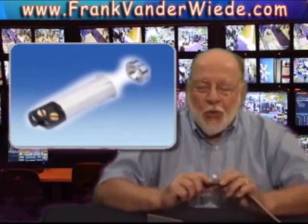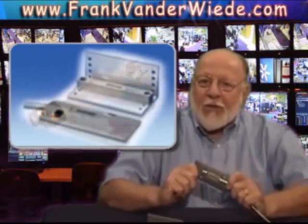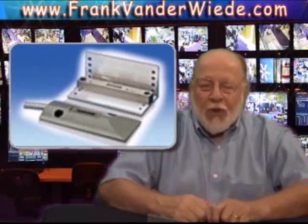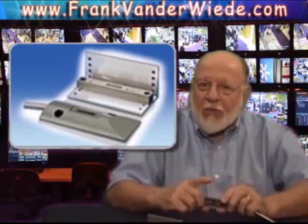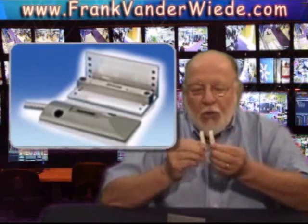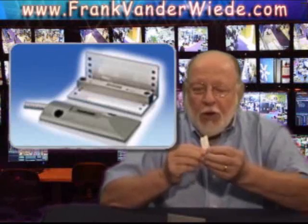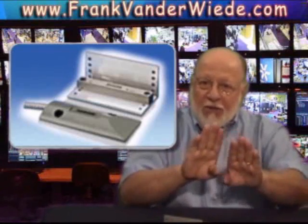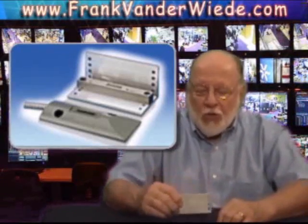The last type of door sensor I'd like to show you is called the overhead door sensor. It is not typically used in a normal home because you would not want to be faced with the problem of jumping out of your car, racing into the house, and disarming your system in 30 seconds — it's just not practical. But if you have a business, a warehouse, or something that uses overhead doors, this is the type of sensor to use. It is durable — you can ride a truck over it — and it also has a lot more play in it. Where a normal window and door sensor would have about a half inch of play, no more than an inch, this will give you two inches. Because garage doors don't typically fit exactly tight, this gives you a little leeway and makes that door secure.